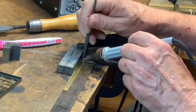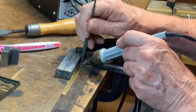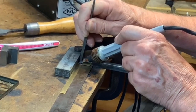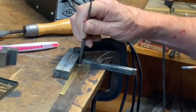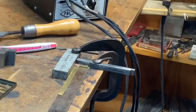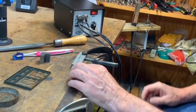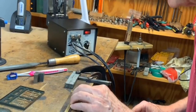Now I've got it set just right, and I will apply the heat. When you are soldering, you know that soldering is taking place because you can actually feel a vibration through the unit — that vibration is 60 cycles per second, because you're running house AC current, though stepped down, through the work. If you don't feel that vibration, then the resistance iron is not working and you haven't completed your circuit. So once that's pulled off, I'll pull it out of the jig, and it's perfect.